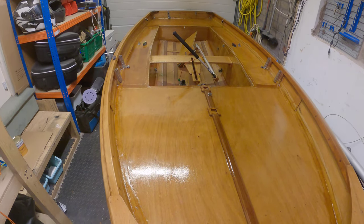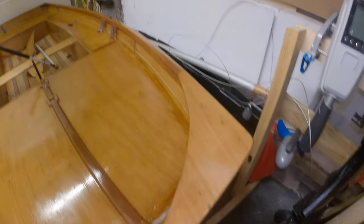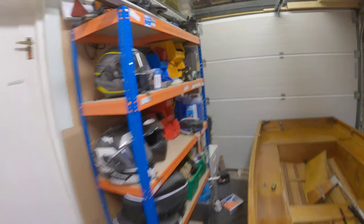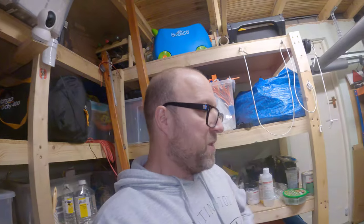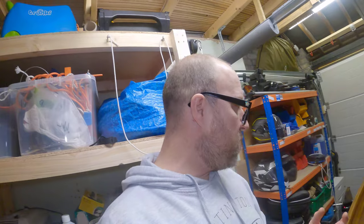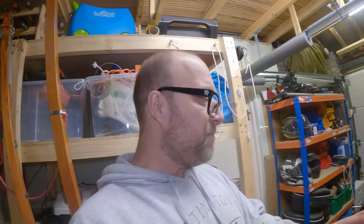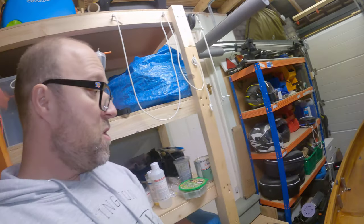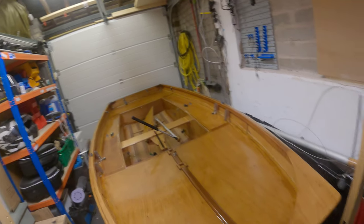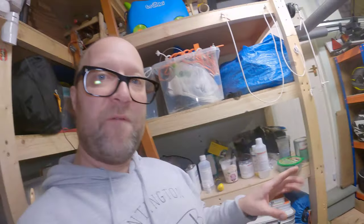You can overcoat the Compass polyurethane in eight hours at 15 degrees. I've been feeling it and it's actually dry in the places I started with already, which is quite hopeful. The temperature in here is about 15 degrees and the humidity is really good. I've done the whole boat apart from the floor — it doesn't need doing and it's got an anti-slip coating anyway. I've just touched up the little chips in the varnish to seal the boat.